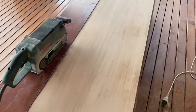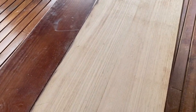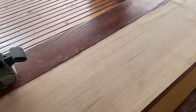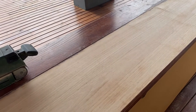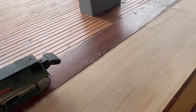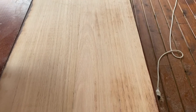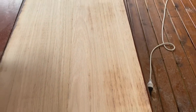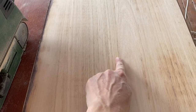I've just stopped it there so you can have a look at a few things. Firstly you can see the difference - I've taken it right down to that raw timber, which is pine in this case, like a lot of furniture. In some patches I will be going over it again so I haven't got it all off. I've had to come through quite heavy. There is a join here which was uneven so I've sanded that so it's an even surface now.